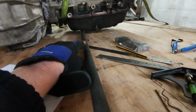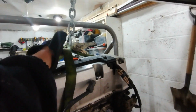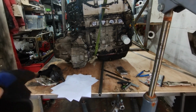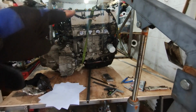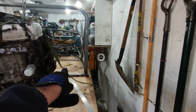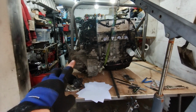So just thinking about this balance point thing, I lifted the engine up and I put that in fairly well over to the left of the sump and dropped the engine back down so this isn't taking any weight. And clearly, even with it that far over, we've still got more weight that side than the other side. So although I've spoken about the whole balance of the car, obviously my weight sat there is going to be pretty well front and rear, because I'm going to be sat pretty well central. This is going to be very much weight on the rear wheels.